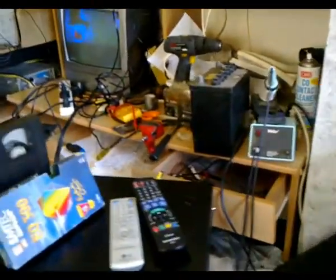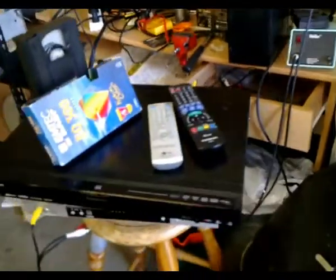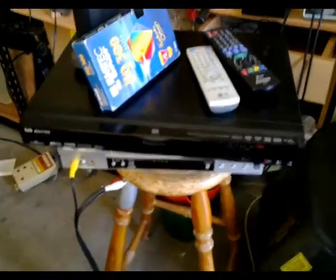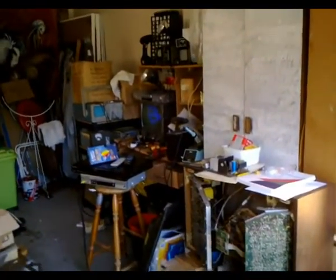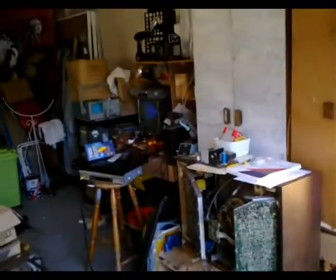I'm doing a direct video signal recording straight to DVD recorder, via VCR, because these old cameras output a DC signal and DC can play havoc with the inputs of a digital video recording device. Yeah, this camera is playing up once again — it was working pretty well for a little while, but it's right again, sort of.